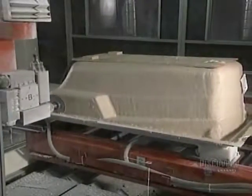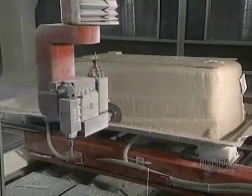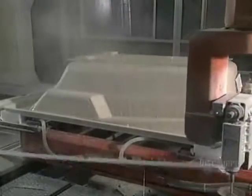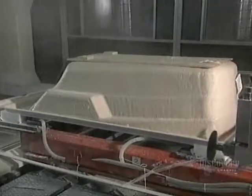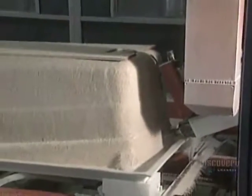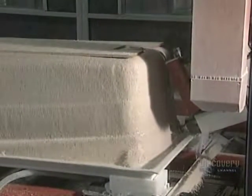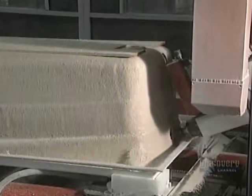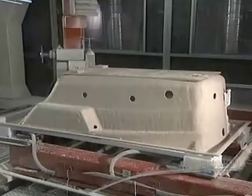The shell is then transported to the milling department. The shell is now dry and hard. They can extract it manually, but here they use digitally controlled machines. The operation begins with the trimming of the edges of the bathtub. During this operation, the robot will also pierce openings for the drains, the whirlpool jets and the air jets for the overflow, as well as for ambiance light.